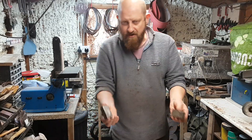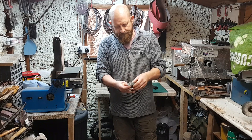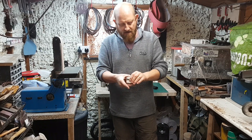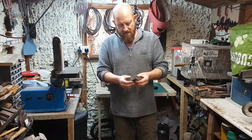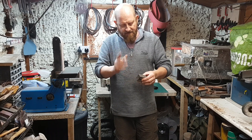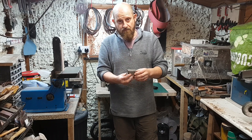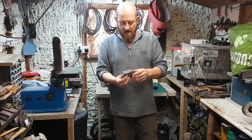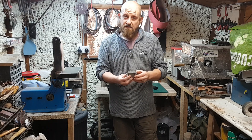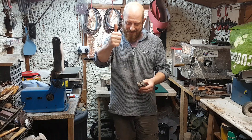So I've got two blocks here, which are 12 layers each. I'm going to give them a clean up and bang them together, so that'll be 24 layers. I might stretch it and do it again — I don't know how it goes. And then I'm going to try something different: we're going to do raindrop Damascus. I hope you enjoy the video, I'll try and make it interesting. And hi to all my new subscribers, see you soon.